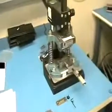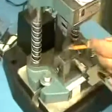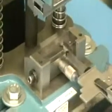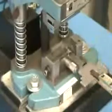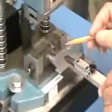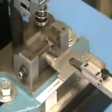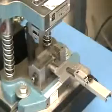Let's first look at the F1B1 and its various components, features, and options. The bottom of the tool consists of a lower cutter, a nesting area for an insert which controls the shoulder dimension, a micrometer to set the standoff height which is dimension A in our drawing, an adjustable backstop to create a nest for the body of the component. The minimum shoulder dimension that can be processed by a standard F1B1 is 35 thousandths or 0.875 millimeters, which is dimension B in our drawing.